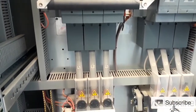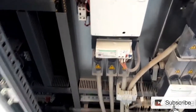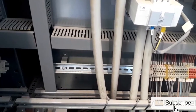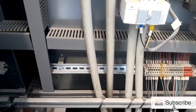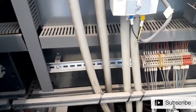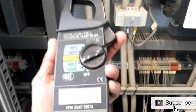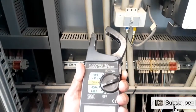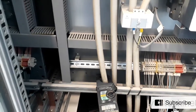We will now try to get the actual ampere reading of our three-phase induction motor, checking only one line to make the comparison. We will use the new Kyoritsu 2007R with True RMS, and compare it against the older clamp meter — also a Kyoritsu — which has no True RMS label. Let's check the difference between the True RMS and the non-True RMS readings.